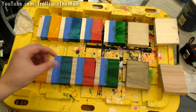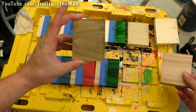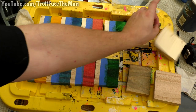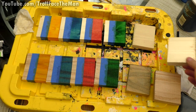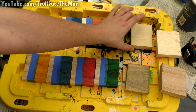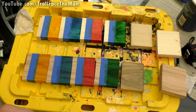We had a really interesting effect that caught me a little bit by surprise. This is the bleached piece of wood — it only has one layer of bleach so far. Untreated wood versus bleached: the bleach doesn't seem like it bleached the wood. It seems like it darkened it on both the pine and the red oak, which is quite fascinating. This is a good indication of why you wouldn't want to use bleach on pieces of wood to clean them — I heard that was supposed to be safe, but this says otherwise. I'm going to do three total coats like I always do.